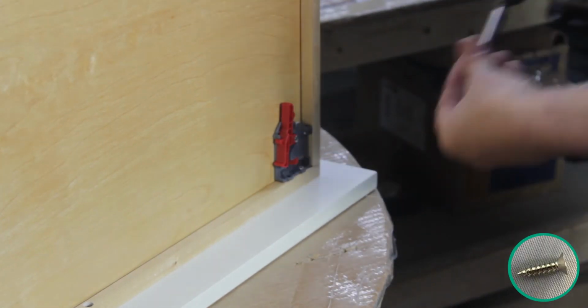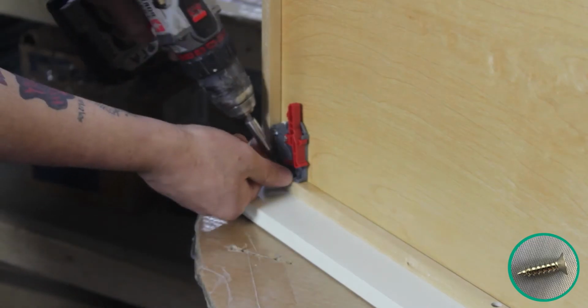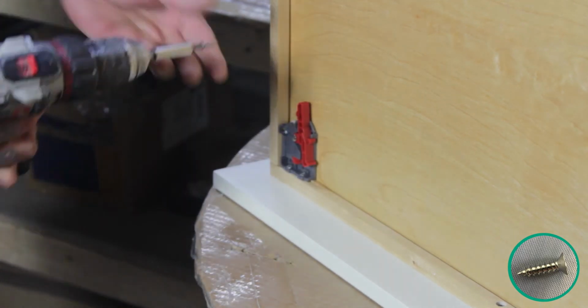Find your glide connectors and place them underneath the drawer in the front corners. Make sure the triggers are facing inward and fasten them down using 4 screws each.